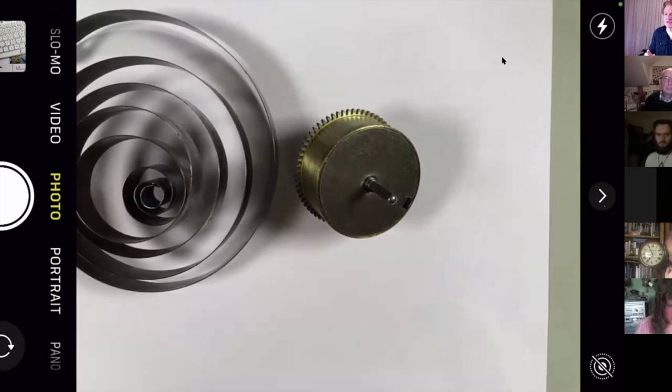And that's a really interesting question, because a new clock and an historic clock are, as far as I'm concerned, totally different things. And what I would say, in this last minute or so, is check everything else first before you replace the mainspring. Only replace the mainspring as a last resort. Check the bushing and the depthing and the escape and the oil and the cleaning and the end shake and all those things that we can talk about more before you replace the spring.